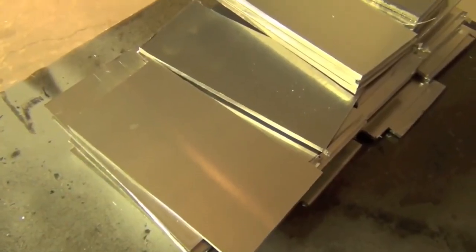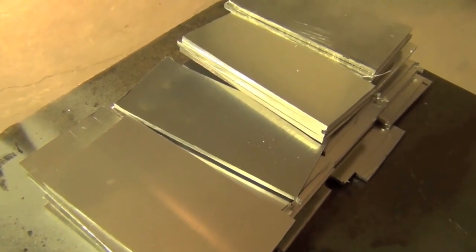One of the most widely known differences between welding aluminum and other metals is that when you TIG weld aluminum you almost always use AC current. The main reason is that aluminum doesn't rust like steel and iron do, but it still forms a very hard oxide coating. Aluminum oxide is really hard stuff - on a hardness scale it'd be relatively close to diamonds - and it has a very high melting point. Your average aluminum starts to melt around 1200 degrees, but the aluminum oxide coating won't melt until about 3700 degrees.